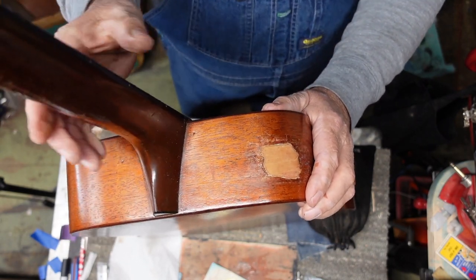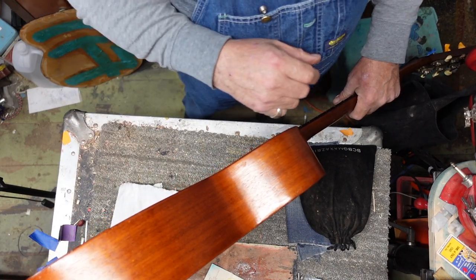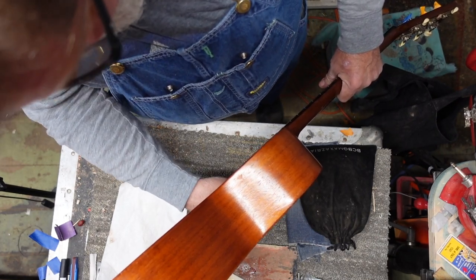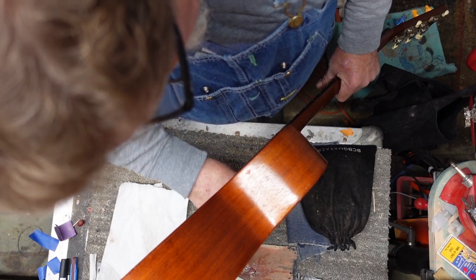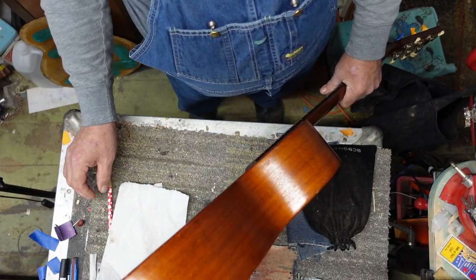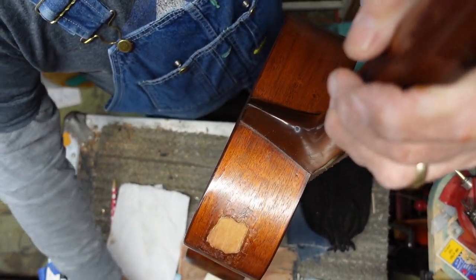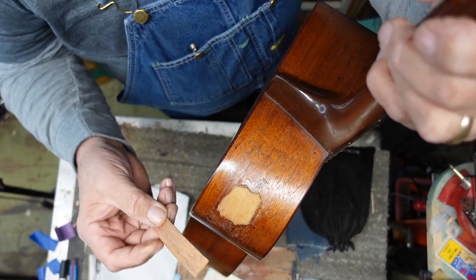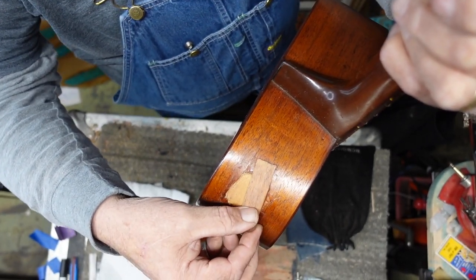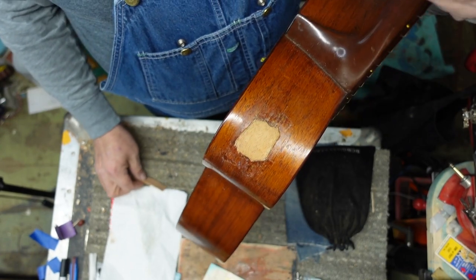So I'm going to take a pen now, or a pencil, and a light, and I'm going to make sure you can't see this, but I can take the Love pencil and go in around and make sure that muslin is flat everywhere, because we want to remember that once this all dries and once I'm done knocking the camera around, I'm going to come in tomorrow and put backing strips. You see that this matches the curvature of the guitar inside here, and then that will be solid. Then we'll worry about finishing it.